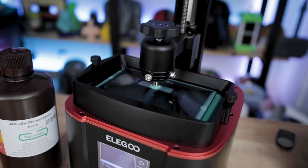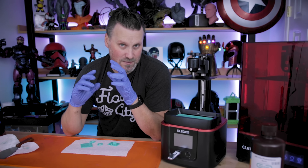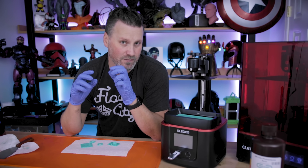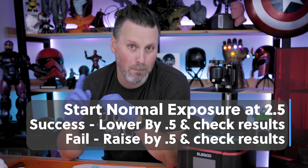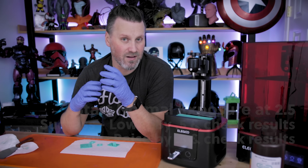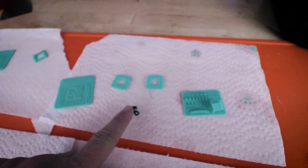What you're going to want to do is rerun this test multiple times in different increments. Because everything printed properly, and to be honest, the default settings might be fine for a lot of you out there working with different resin printers. It all comes down to exactly what you're trying to print and the level of detail you're trying to get out of it. If you really want to dial in those settings, you can further refine these as much as you need. What I like to do is, since I started at 2.5, immediately drop it down by 0.5. I either like to go up or down by a good chunk of a number, and then based on those print results, I'll either go back up slightly or start moving further down. I started off at 2.5, which is the recommended setting provided by Elegoo, and it's just a great overall good place to start.